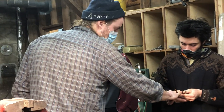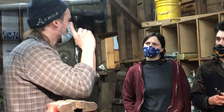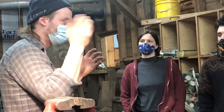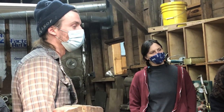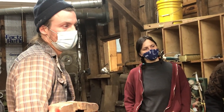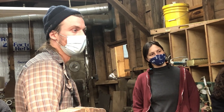I don't know if you guys remember, but when Tyler was talking about that countersink, where he had seen that little flash of red going around it, we were drilling the stainless, and it was work hardened, and you get a burr in there that's super hot. You're not being able to keep the bits cool, or running them too hard, or not having enough cutting fluid on them, any of that stuff.